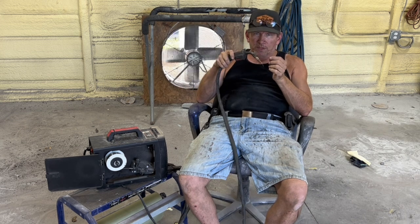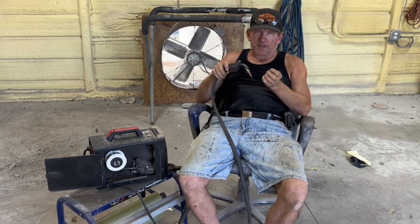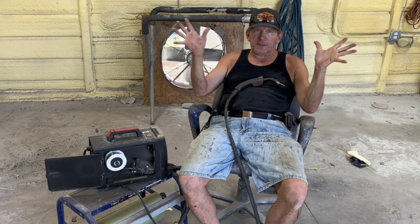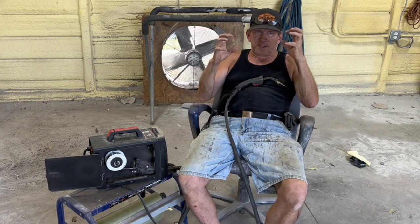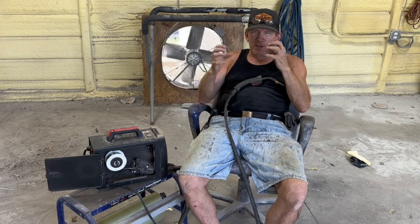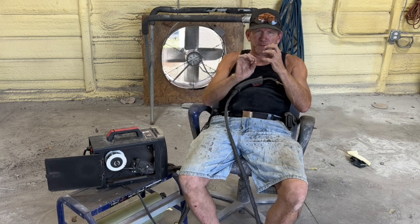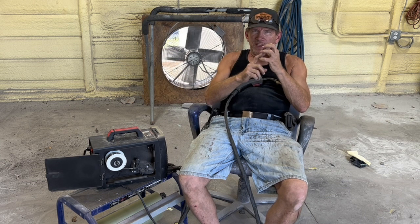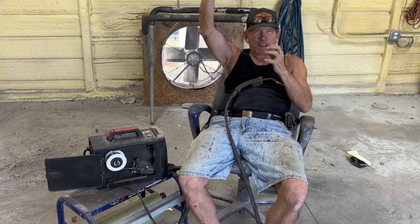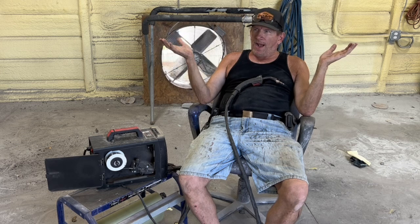And when you start that puddle right on top of it, right next to that other one, the flux is doing the same thing it did on the first one. It is coming from the center and pushing out the impurities. So if you got this weld already there, and it's got some of that flux dust on it, and you come here and you create this new expanding weld that's pushing out impurities, it's melting this edge that you're up against, and it's pushing that dust out of the puddle too. It's pushing impurities out. I don't know how to make it any simpler.